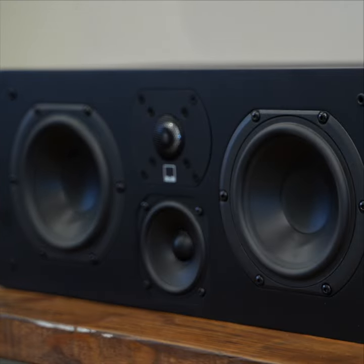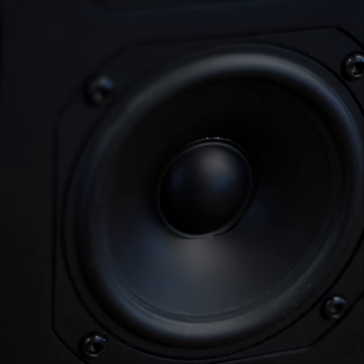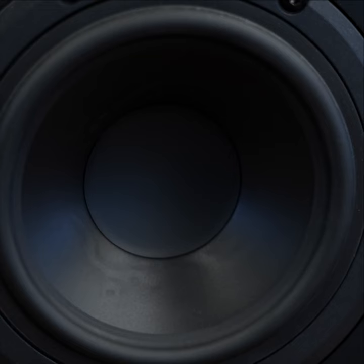The center channel speaker has 4 total speakers with a 3-way design. It has a 1-inch aluminum dome tweeter, a 3.5-inch midrange driver, and dual 5.25-inch woofers. This helps it achieve a well-balanced sound and it has a lot of punch for this size of speaker.